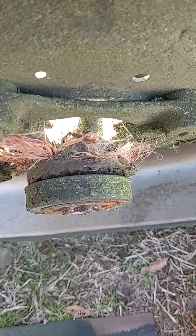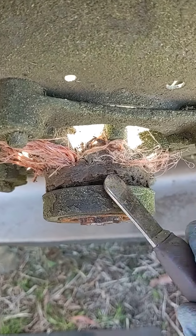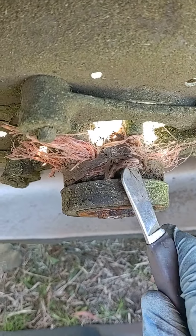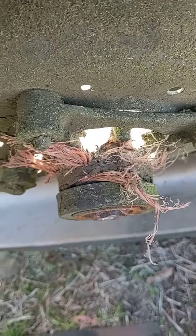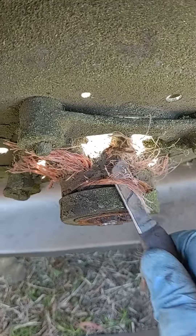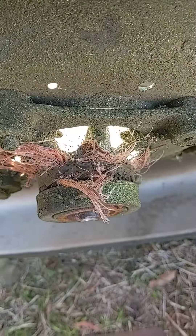So we're going to cut that off there with a knife, with scissors, whatever you got that'll take it off. Wow, that is really tight on there, but without taking this off it would cause a lot of damage — so please make sure that you check when you're sharpening your blades and get any twine or anything else out from around your spindles.